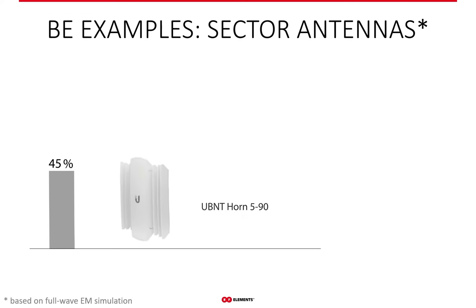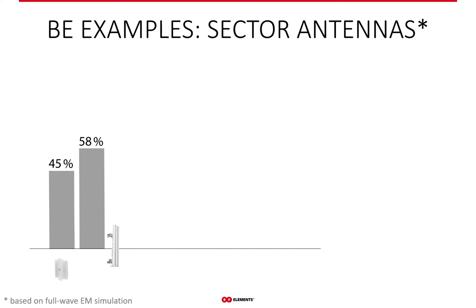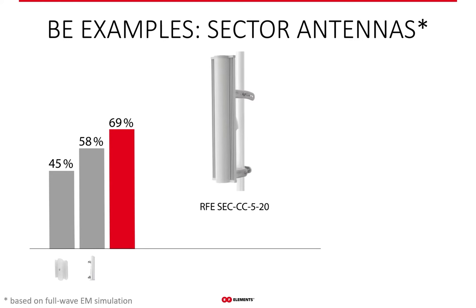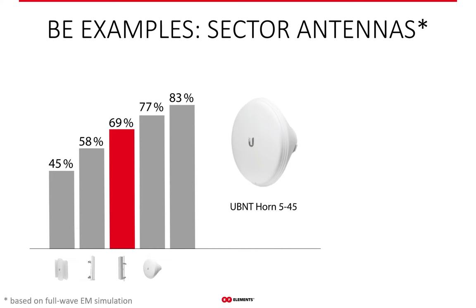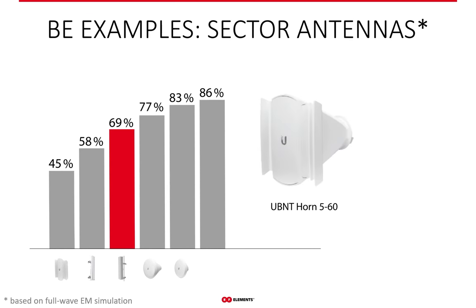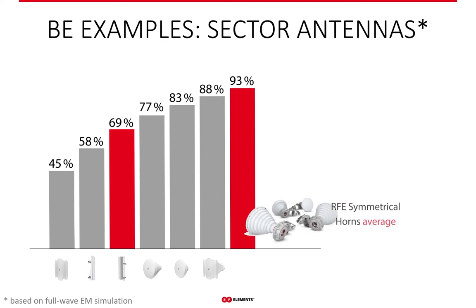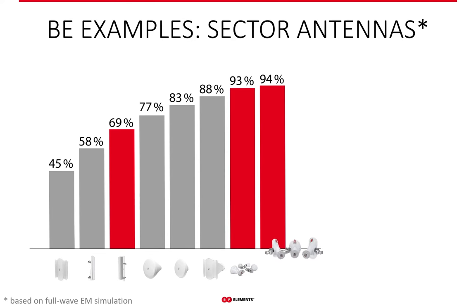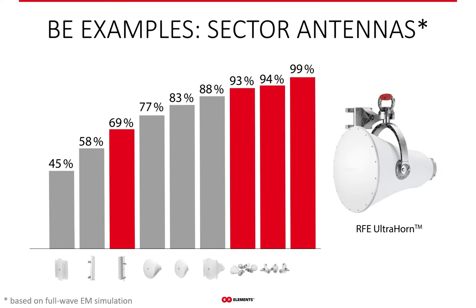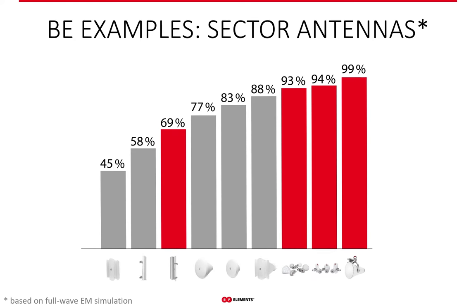The vast majority of antennas used for sectorial coverage in WISP networks are either patch arrays or horns. Patch arrays have many frequency-dependent side lobes, so their beam efficiency values are somewhere around 60%, depending on manufacturing and design quality. The RF Elements horns, both symmetrical and asymmetrical, have beam efficiency of somewhere between 90% and 95%. It actually takes considerable effort to design a horn antenna with high beam efficiency — a stable, zero side-lobe radiation pattern is not a given just because you use a horn. We put a lot of effort into our antennas to achieve beam efficiency of at least 90%.